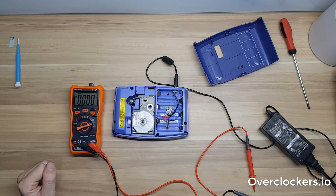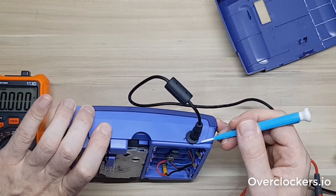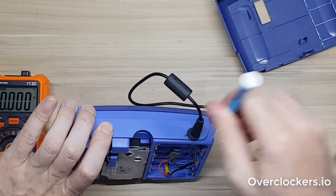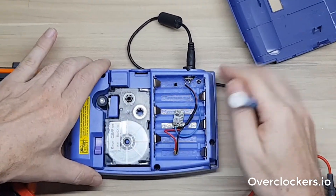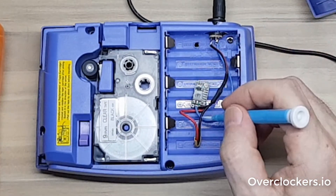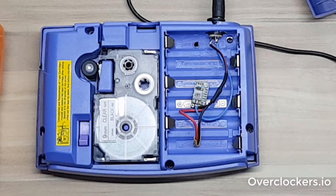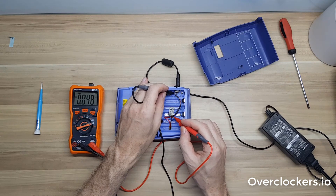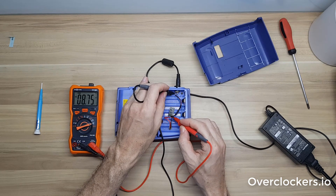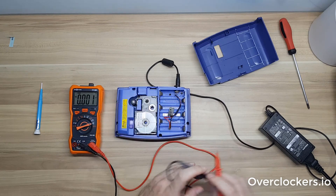That took me a little more time than expected, mainly because I didn't have a drill bit that fit the barrel jack perfectly, so I had to roughly cut a circle with the drill bit and pop it in. Soldering: ground to it, input coming into the input, output to the output. Testing the voltage — with ground here and output here we're getting 8.75 volts, which is good enough. I was hoping for an even 9 but just under 9 volts should work fine.